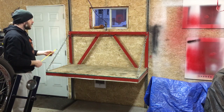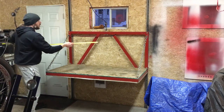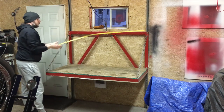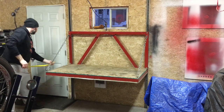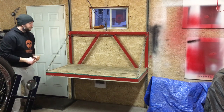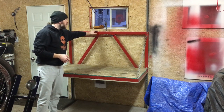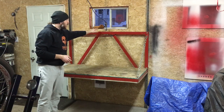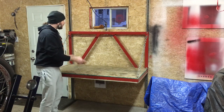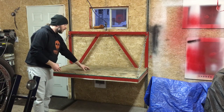The lift itself is 59 inches wide by 31 inches deep. It's constructed from 1x2 HSS steel with 1/8-inch wall. I custom fabricated the lift platform myself. I'll lift it up and show you what it looks like underneath so you can get an idea of how this base is supported.